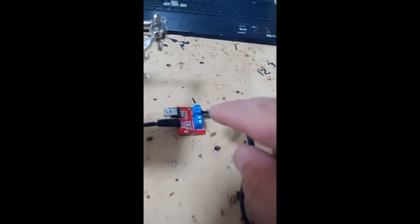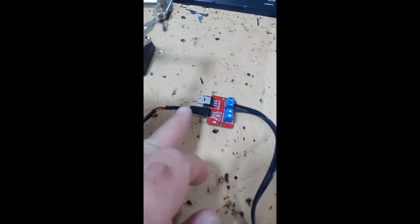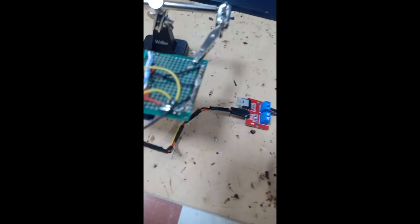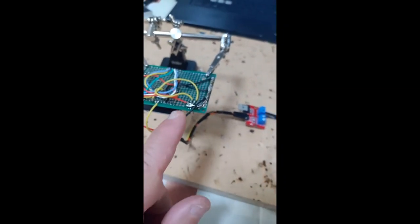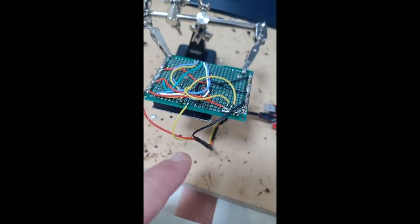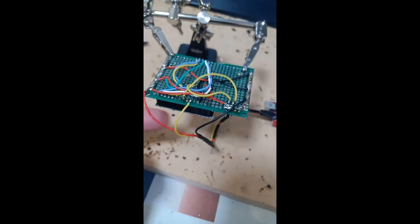The next step is adding the motor. As you can see in the RX sketch, the motor is located at D3. Two wires from the motor go into the MOSFET module, connected to positive and negative. From the MOSFET we have three wires: black is ground, red is positive, and yellow is the signal. The black wire from MOSFET goes into the negative line, the red wire goes into the red line, and the yellow signal wire goes to D3 on Arduino.